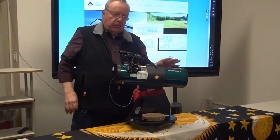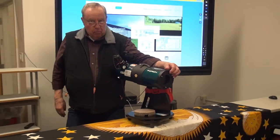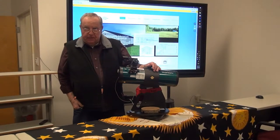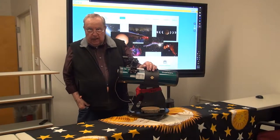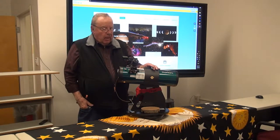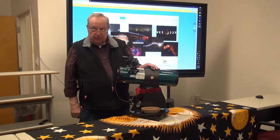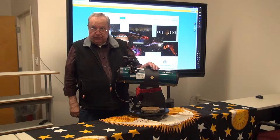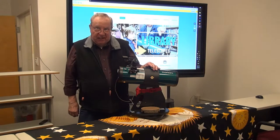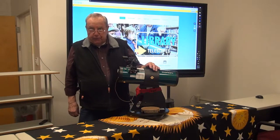We modify this quite a bit. One of the things we do is remount the main mirror cell to make it a little bit more sturdy. We change the eyepiece from what had originally been two separate individual eyepieces to a variable power eyepiece. The Easy Finder, which is a locator — originally when it comes from Orion, there's a CR2032 button battery underneath the front cover. We're replacing it with a box that holds two AA batteries that last a lot longer — anywhere from 25 to 30 hours easily instead of two hours, especially if the Easy Finder were left on during a viewing session.